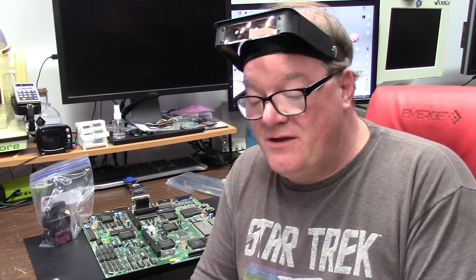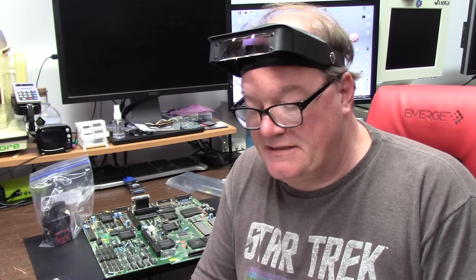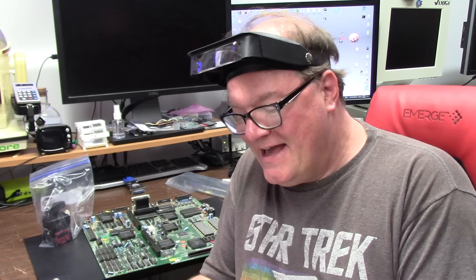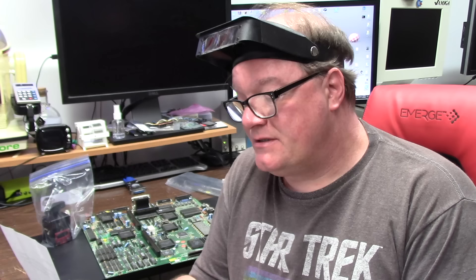There's a note that says: Hello Dr. Chris, thank you for taking a look at my Amiga 3000. This does boot into a kickstart and was able to test VGA output via the scan doubler. It doesn't have much 15 kilohertz — I'm just getting back to speed and haven't tested much else. That's why I sent it in. I cleaned up the battery acid and flushed under the chips with vinegar, distilled water, and IPA. I worry I missed some. Could use your professional touch. There you go — that'll be eight dollars. I can see some damaged traces and vias that look shady and will need a solder drag or so. I'm not sure if there's enough left on the mounts, but a new battery socket will be awesome.